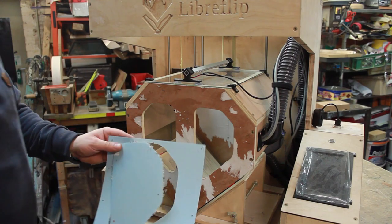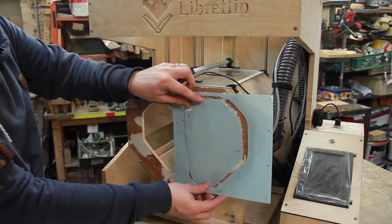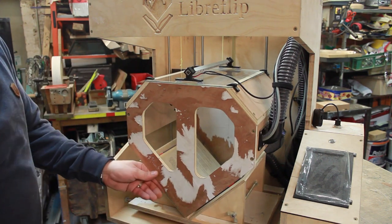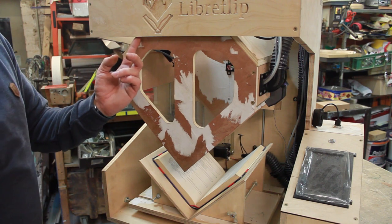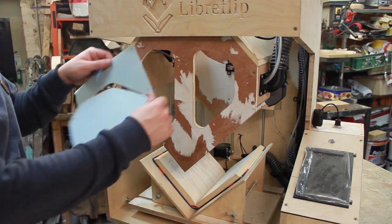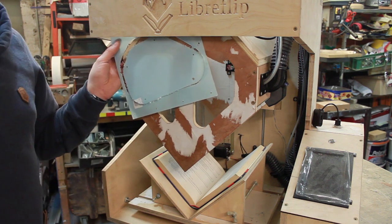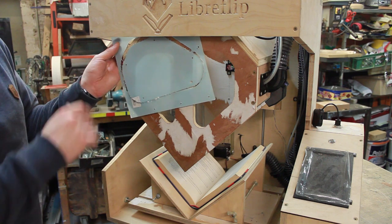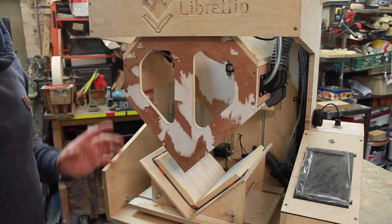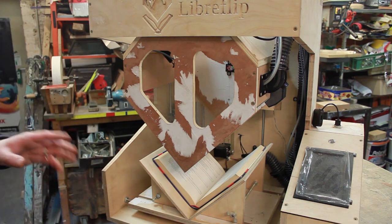So this is what came from the CNC and it goes on here like this. If I move the suction box up, there is a small gap between the top board and the front of the suction box, and this plastic is supposed to fit in there — but very tightly. This is supposed to have three millimeters of space and it only has about one. I was wondering why that is, so come with me to the back of the machine and I'll show you something.